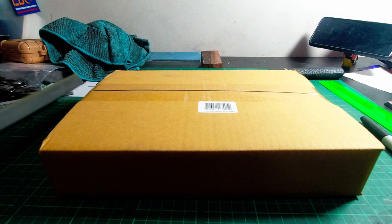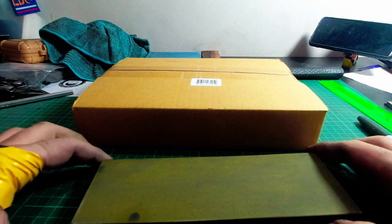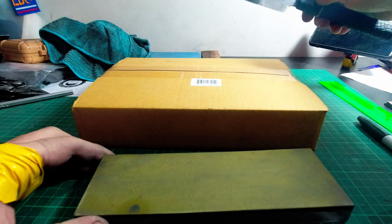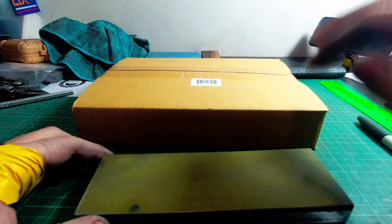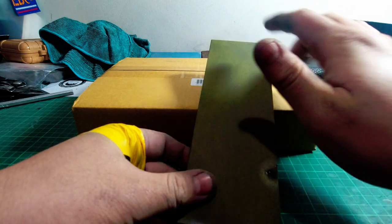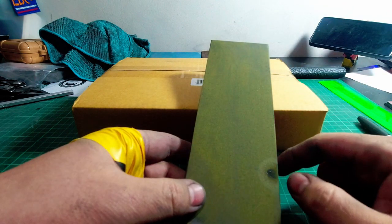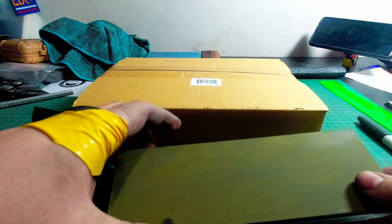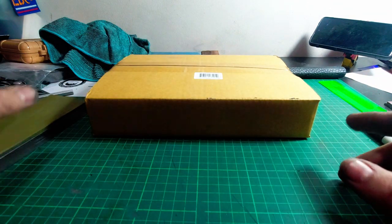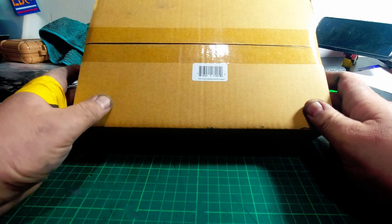Okay, I'm using this stone to sharpen some yanagibas. I'm starting to feel that it's a little bit uneven. You can feel that because we go at it at an angle. So here and here, they're kind of high points right now. I can feel it. It's starting to annoy me. So I'm needing to lap it. That's where this guy comes in.